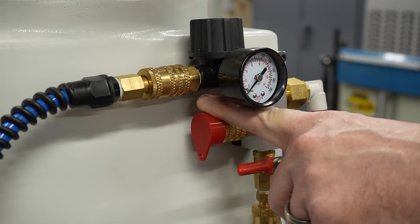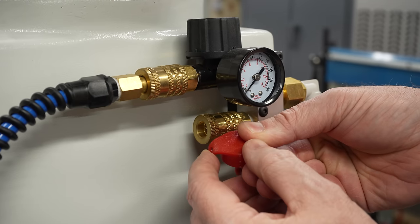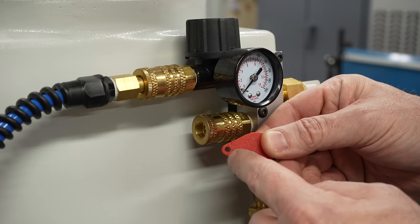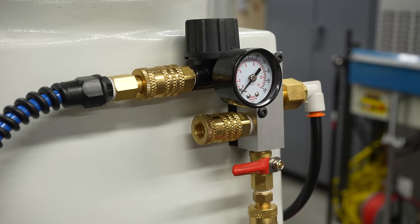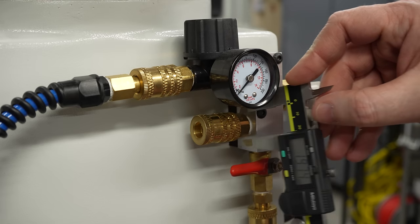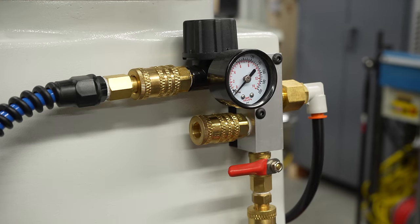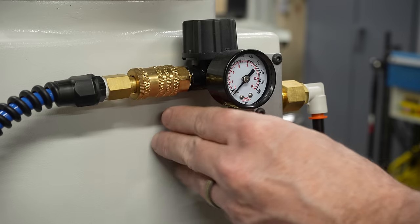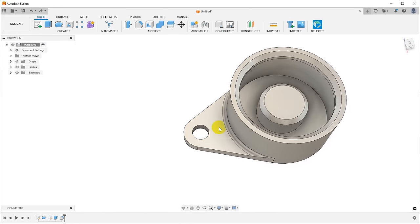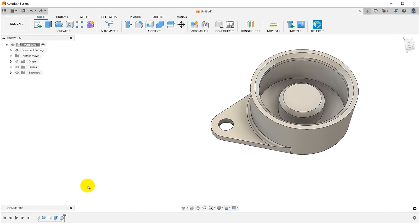As I'm thinking about it, I'm realizing there's no reason we have to use some other material for the lanyard. We don't need any string — we've got flexible filament here. We might as well just 3D print a flexible strap to hold this on, some kind of integral lanyard that goes around the base of the connector. I just need to know how big it needs to be: off the back it's about 14 millimeters, around the hex it's about 19, so somewhere in between would be a good diameter for a loop we could stretch over the connector.